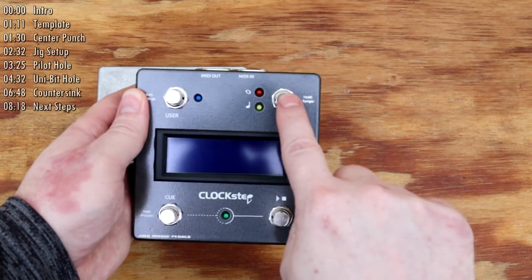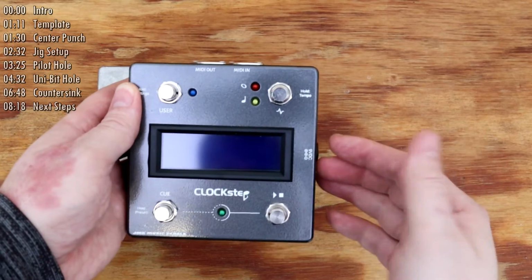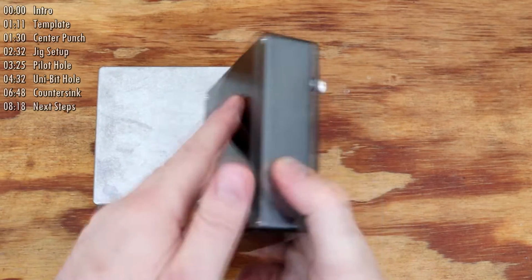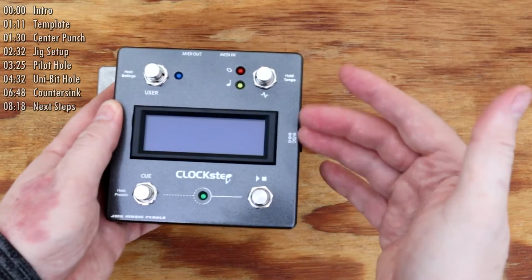First, using a benchtop drill press for making holes. Then using a benchtop vertical mill for making rectangles. Then using a powder coating gun and oven to create the finish. Then silk screening on the artwork. And then the final assembly.